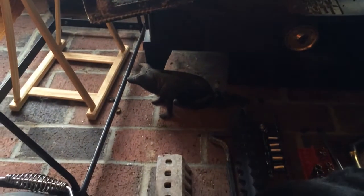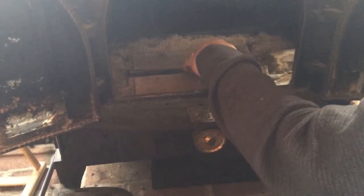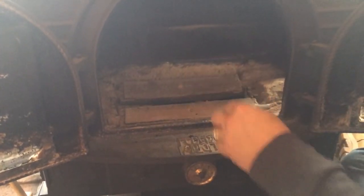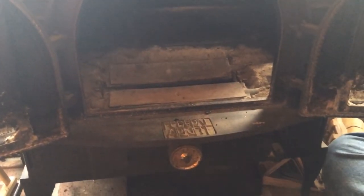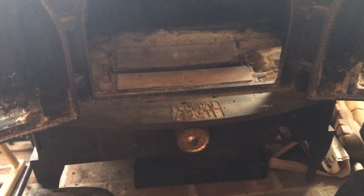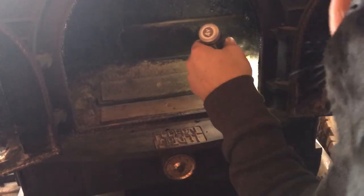Now that we have that out, the old broken pieces come out. In between all the steps we've been performing you would have to do a ton of vacuuming. I've left a lot of the ash inside the bottom of the stove because that ash helps protect the plate when you put it back down. This is all accumulated ash that sits under the plate — I'm probably going to vacuum out some of this. You want to leave some ash down because it helps protect that floor plate.